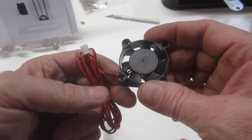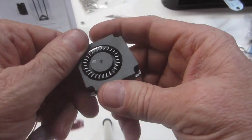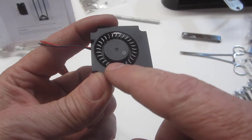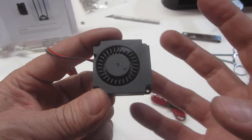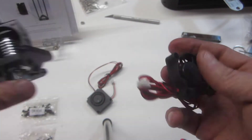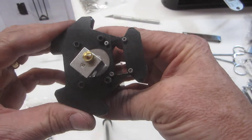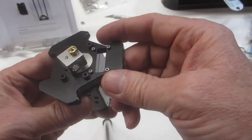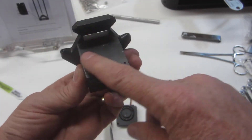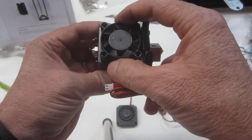The kit provides two fans. There's a traditional-looking blower fan, typical of what you'd find in a small computer, and also this scroll cage fan. The scroll cage fan directs cooling air over the bed of the printer to cool the actual filament after it's been extruded — to freeze the filament to the layer underneath it or to the print bed. The blower fan keeps the hot end itself from overheating by blowing over these fins right here. When you put the effector together, be sure that the hexagonal plate is fitted so that the slot for the blower fan is adjacent to the flat, closed side of the effector housing, and the open side with the big round hole is where this scroll cage fan is going to go.